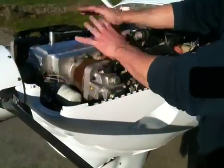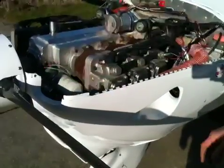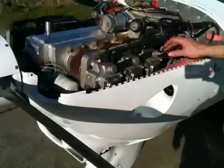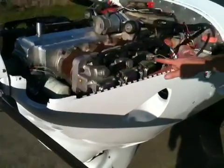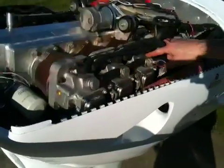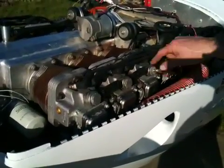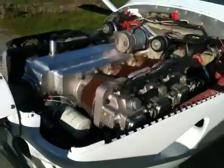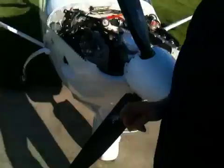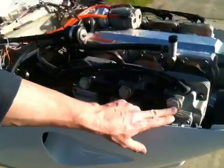As you can see, this aircraft has none of those fiberglass ducts — we just let raw air come in and ventilate and cool the entire engine. There are no fiberglass ducts at all. These are our six liquid cooled heads. Here's our common rail for the hot water out, and there's our thermocouple for water temperature — a long probe going into the water gallery straight through the aluminium banjo. I'm also monitoring all six cylinder heads for CHT.